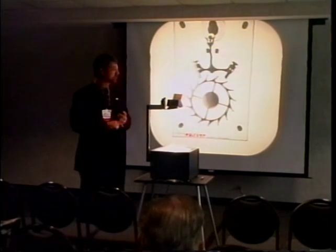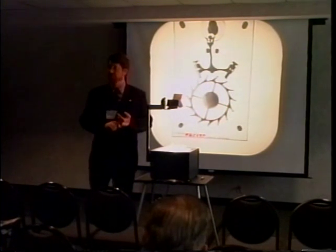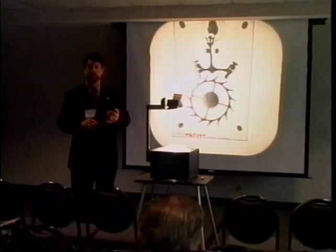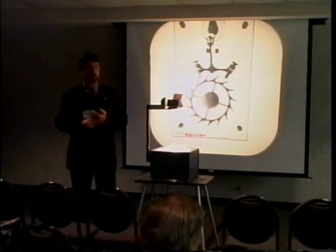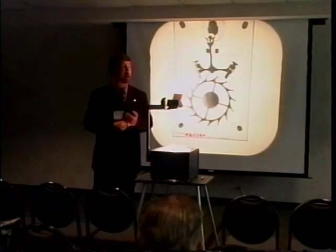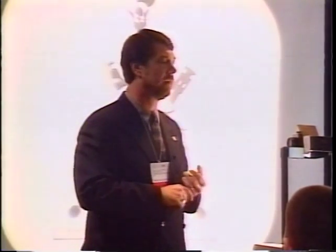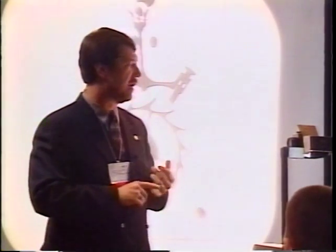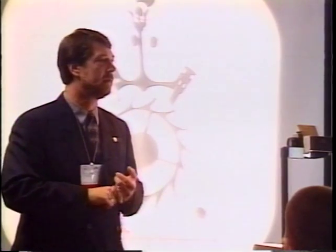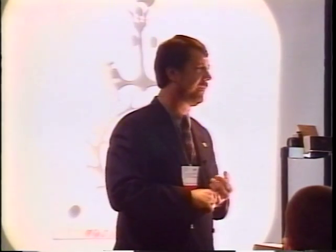Before we even get to the escapement, there are some things we need to talk about as far as proper cleaning. We're not going to go through that, but the watch needs to be properly cleaned. Especially nowadays, with the old automatics wanting to come back for restoration, as you would say now, or repair when I was working in the stores. Barrel wear is very important, and a lot of people miss barrel wear. Then there is proper adjustment of the barrel arbor to the plates, proper lubrication of the bridle for the mainspring, and, of course, the train has to be nice and clean and free.